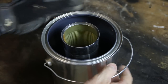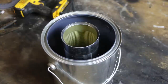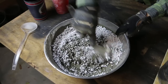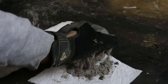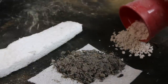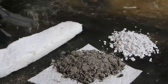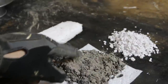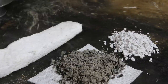Now with my can assembled, let's discuss the insulation material that's going to go in between the paint can and riser cans. There are lots of options when it comes to insulation. Of course I used a concrete and perlite mixture in the last build, but this time I'm going to go with something dry. I've got some scraps of mineral wool. There is a recommendation in the comments to use wood ash, which would also work. Perlite of course is also an option. In fact I'm going to use all three.